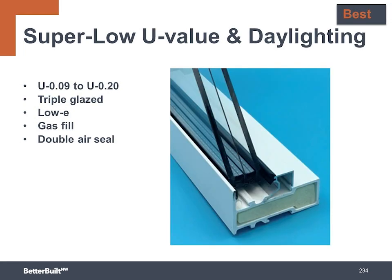There is a new exciting option for triple pane windows that is starting to come to market. Often referred to as thin triples, these windows have a very thin piece of glass for the middle pane, significantly lowering the added weight of the unit. Thin triples are lowering the cost of high-performance windows because the reduction in weight allows manufacturers to use a lower cost frame component compared to traditional triple pane windows that require a substantial increase in frame structure. Ask your window supplier about thin triple pane windows.